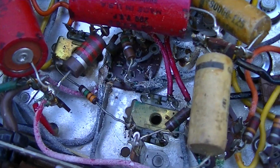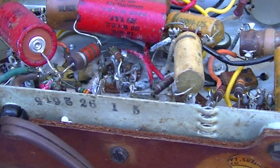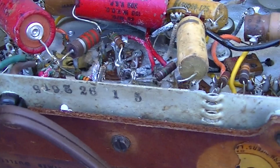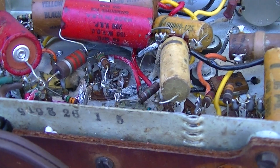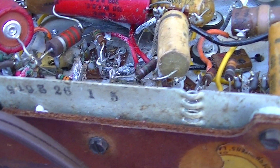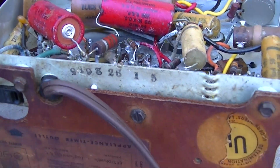Now, I'm going to assume that with the capacitors removed from both cans, if the thing receives anything, it's going to be kind of everything, because without the capacitors there will be no defined peak, and it'll just be like a wideband transformer. But there might not be enough gain for any signal to pass. But I would think it might tune KNX, just because that's so strong here. And yeah, then it would be a dedicated CBS radio. But let's do this one, and enough talk.